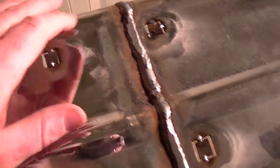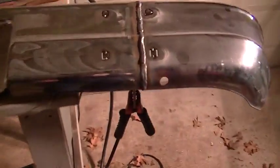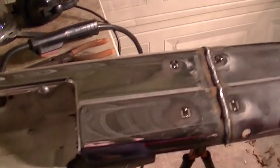It's still fairly thick. So that's not something that you would want to do, say, on sheet metal that's 18 or 20 gauge thick. You want it to be as flush as absolutely possible, because if you grind down a piece of 20 gauge, then you've got a piece of 26 gauge, and that really won't work. But on this, I pop them up a little bit so that when I grind it flush, I don't have any low spots. I really try to avoid body filler